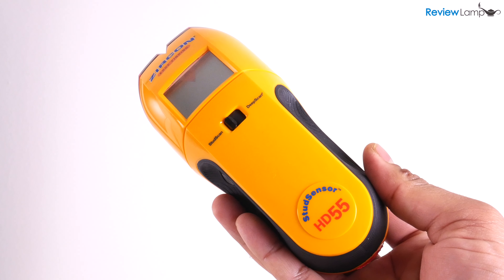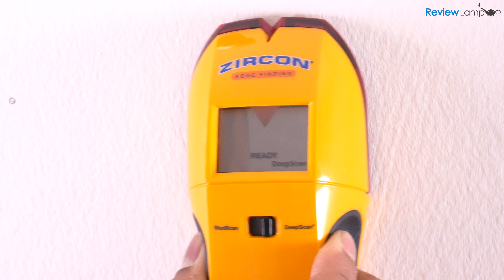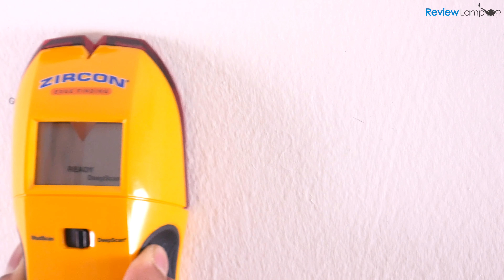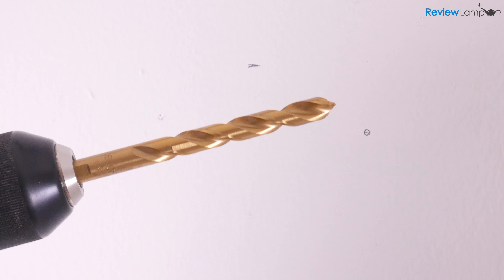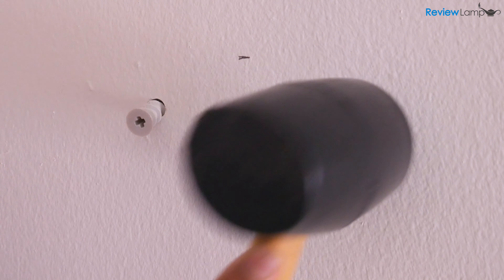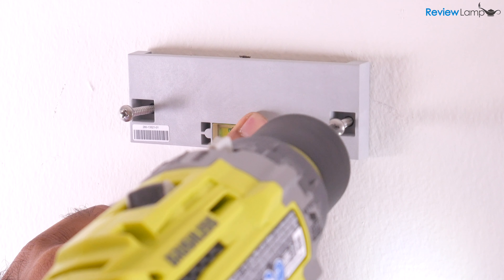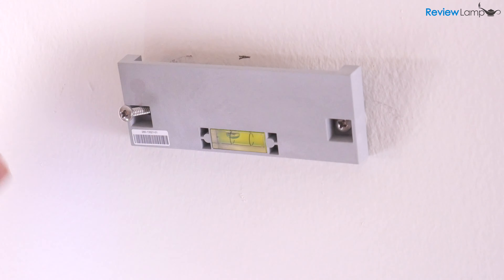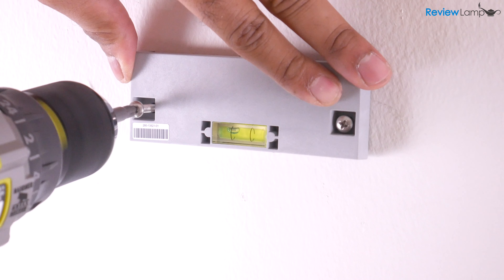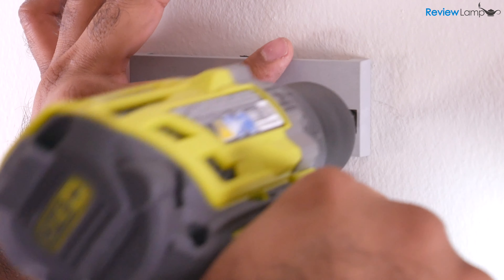This is where the stud finder comes in. Do a deep scan of the marks on the wall to make sure there are no studs or electrical conduits that you might damage when you drill. Put your 3/8 inch drill bit into your electric drill and drill through the drywall. Place your anchors into the holes and tap them in with your hammer or mallet until they're flush with the wall. Grab your screws and attach the mount to the wall — make sure the liquid level is on top. This mounting procedure is for drywall; if mounting to concrete, the procedure is nearly identical but you'll need concrete wall anchors instead.